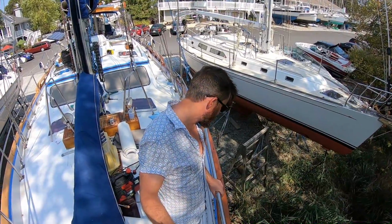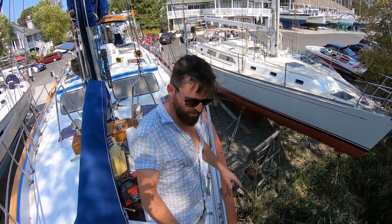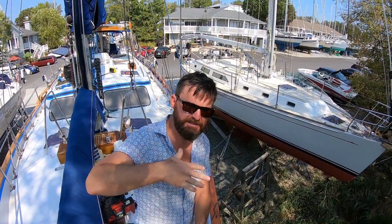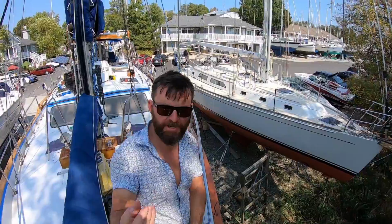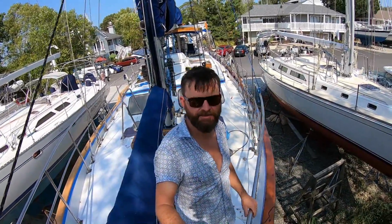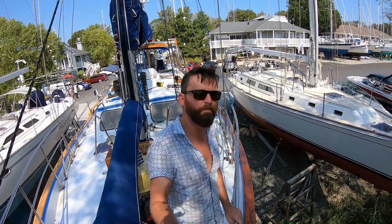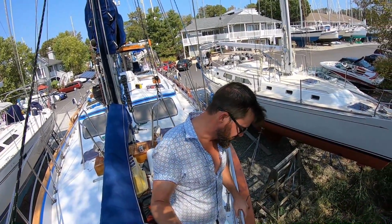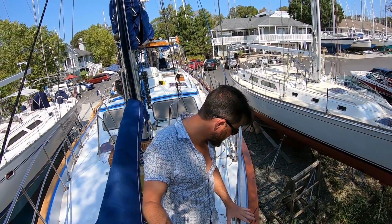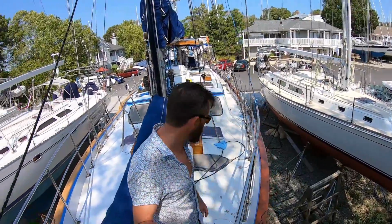After you apply it, for the next 30-40 minutes I'm just walking up and down the rail with the brush, lightly brushing out the air bubbles that pop up. From working on this other stuff, the air bubbles on the second and third coat were much fewer. I think it has to do with the trapped gas in the wood. But definitely the next 2 applications should be a lot easier.